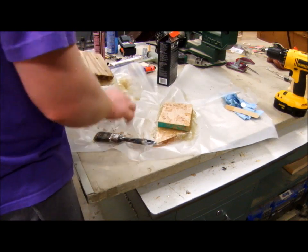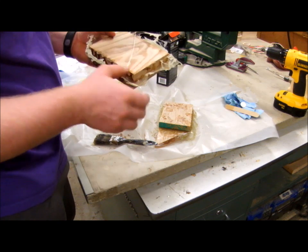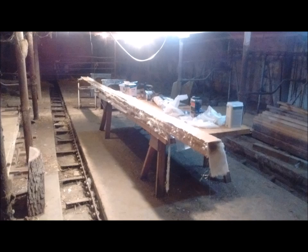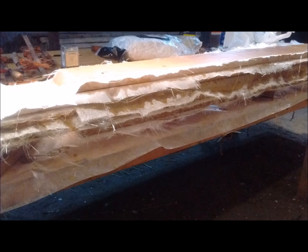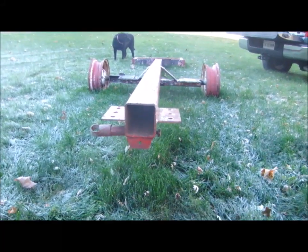Here's the final product. I was pleased with how well the resin adhered to the wood and the cloth really only added about a 30th of an inch. Here are pictures of the final assembly doing the entire arm — we just left the cloth and resin hanging out the side, trimmed it up later, then put a coat of fiberglass and sanded that down to make it look real nice. It did end up being a little thick and we had to shave the end to get it to fit inside the steel tube, which was quite extensive, but it worked.